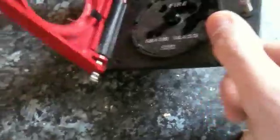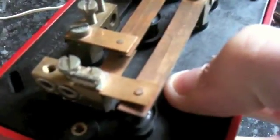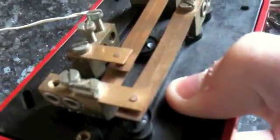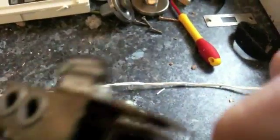When you open it you've got a push-to-test button here. If we look at the circuitry: you press the push-to-test and it will complete the circuit, because when that button is pressed in it's not making any contact. When the lid closes, the push-to-test button is held in place. When you break the glass that goes down to create the circuit, but if it's open the push-to-test contact is broken, so it's still not making the circuit — you'd hit the test button to complete it.